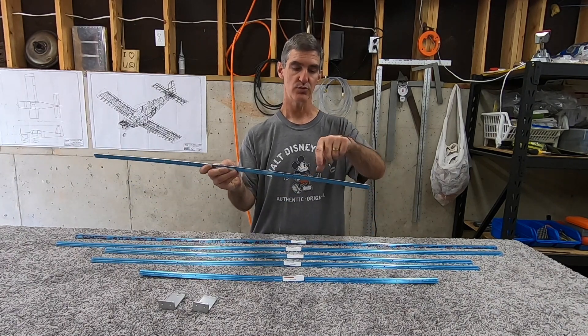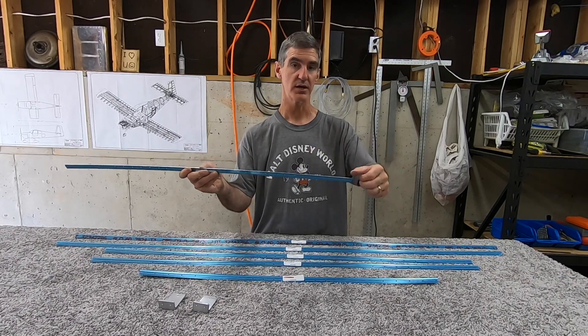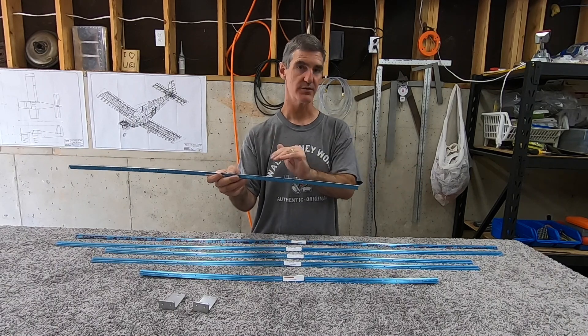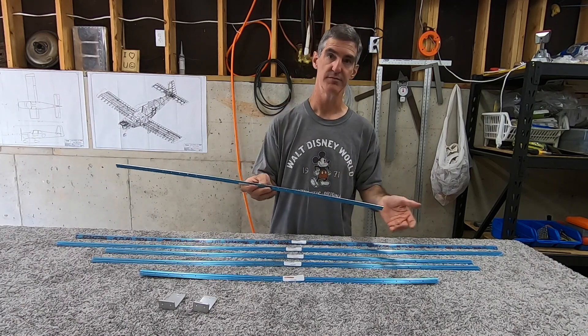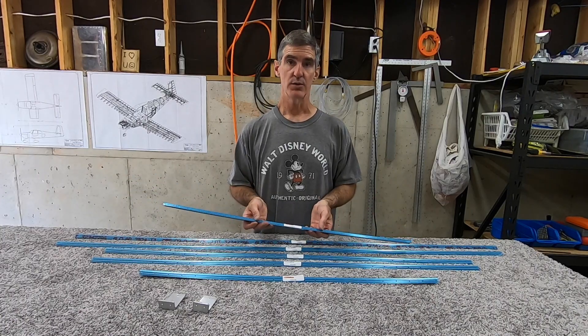The plans are explicit. Where you are connecting and cutting using these notches, you cut away the notch - you cut past the notch just a little bit so that by the time you're done, there won't be any evidence of the notch ever having been there. So I'm going to get going on that.